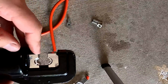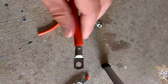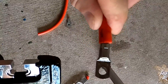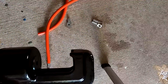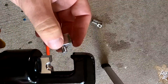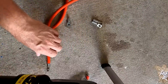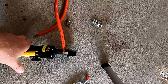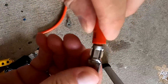I've used the 16mm dies here for the hydraulic crimper but I'm not 100% satisfied with the crimp result - it looks very weak. So I'm replacing these with a 10mm die and crimping again. Yeah, that looks much better.